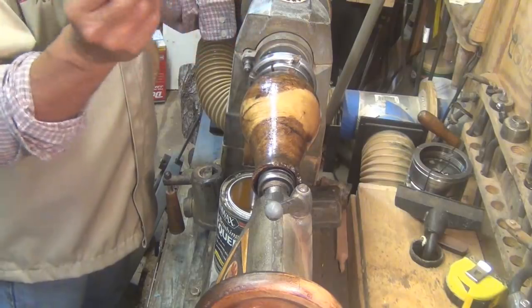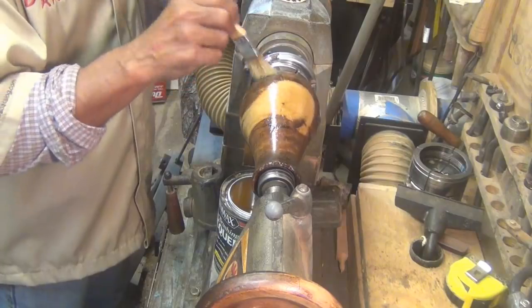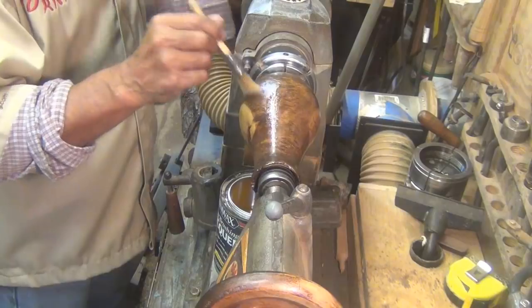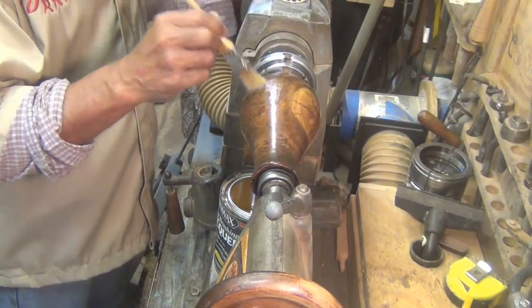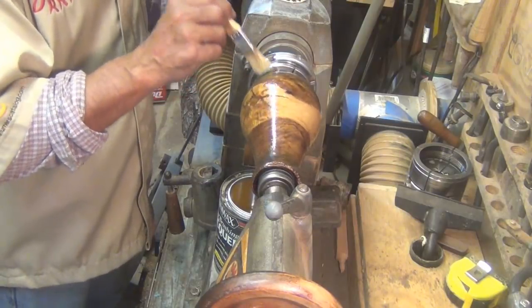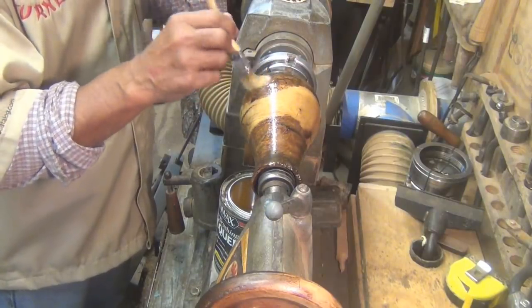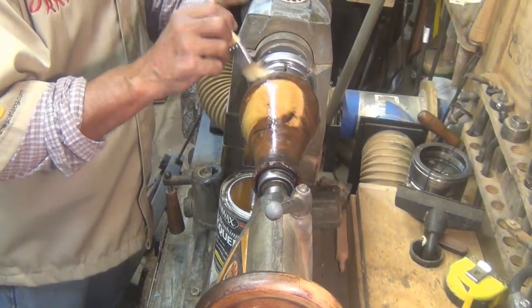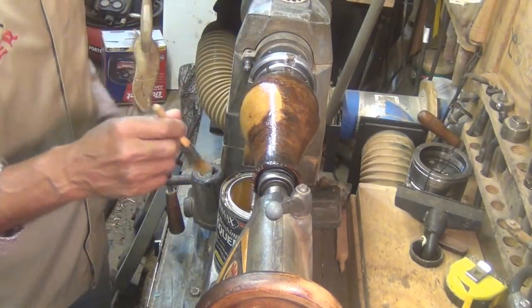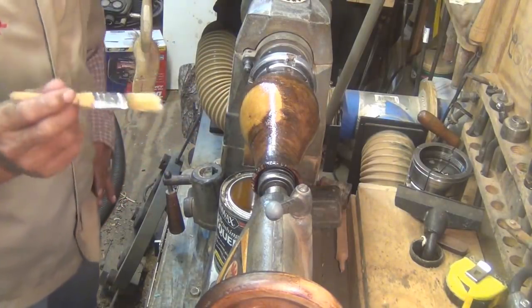So the brush pretty dry though, not wet from the can, just stipple it up, and that gives you a nice subtle finish. It's still well sealed. The effect that you get will be a very uniform look all the way through the piece, but stipply looking. As it tacks, if you happen to go back and your brush is a little bit too wet and you lose that effect, don't worry about it.